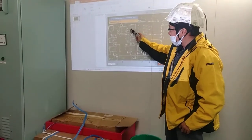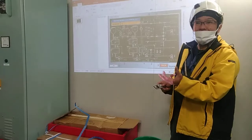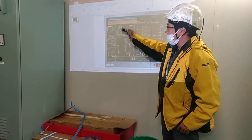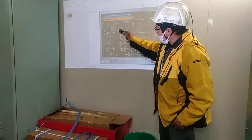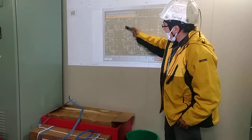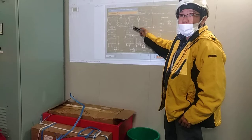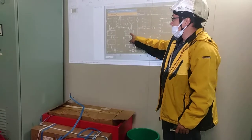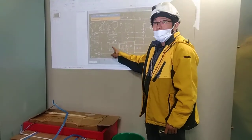Inside the fresh water tank, we have also the heater, because if it's cold water, the chemical will not dissolve well. So we have the heater here and then we have a temperature sensor. So almost from 30 to 35 degrees, it will heat up. When it's already in the temperature range, automatically this valve will open and the water will go to the AS2 tank. So this is fresh water, so it will come into this tank and then we have the chemical. This valve will automatically open and then it will put the chemical. And then here we have the CM1, we have the pump mixer. So it will mix here at a given time. At a given time it's mixed and then this valve will open and this solution is ready now.